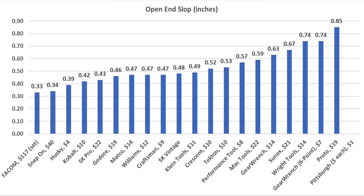I put together a tester using some pretty soft coupling nuts to see how much torque each wrench can handle before rounding off the fastener. To provide an apples-to-apples comparison, I'll extend the length of shorter wrenches so all are tested at 8 inches. The Pittsburgh rounded out the nut at 230 pounds of downward force. The 12-point Husky has a lot less slop compared to the Pittsburgh and outperformed it at 277 pounds. I had to stop the test on the 6-point GearWrench at 248 pounds as the wrench began bending. The Performance Tool became an open-end wrench at only 206 pounds. The Craftsman lost grip at 225 pounds. The Cobalt performed better at 267 pounds. The Crescent beat the Cobalt at 270 pounds, and the Tekton performed almost as well at 266 pounds.